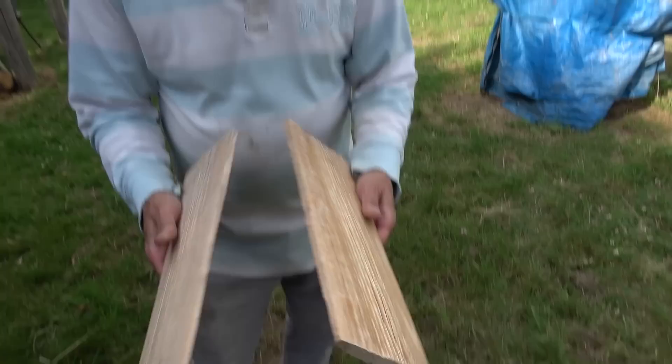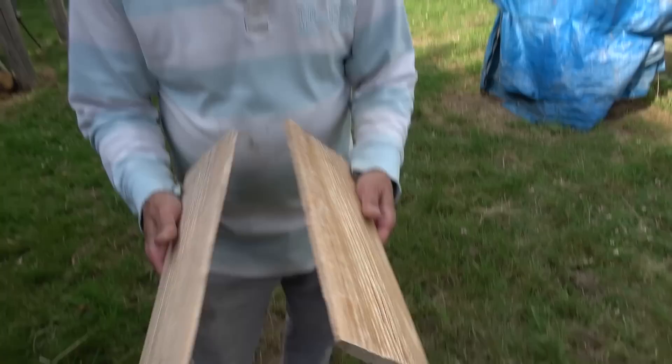We go out into the nice daylight and compare the two. There's the larger radial one. Just look at the difference in grain — the grain runs differently, so you can tell straight away how it's been done. You'll see the two different sizes. That's why I go for 15 inch with a gauge of four and a half inch — I've got a bit of tolerance. I quite like it rustic. So that's the difference in terms of flatness — they butt up reasonably well. That's made across, and that's made radially. Thanks so much for showing us, thanks John. I hope you enjoyed watching John and seeing how the shingles are made — we'll try and put a film up sometime of laying some of the shingles.